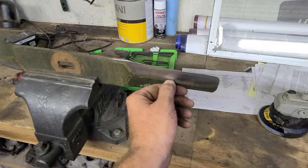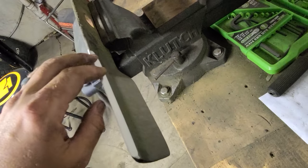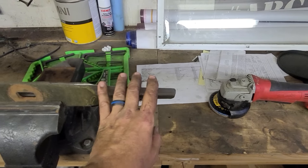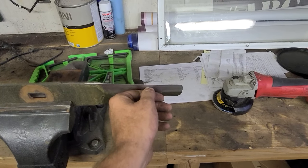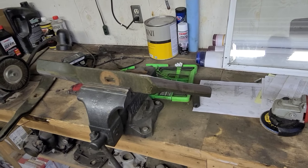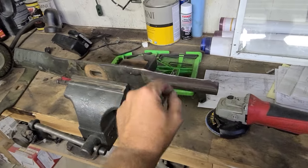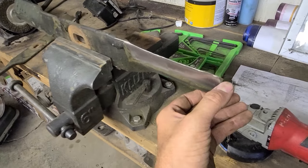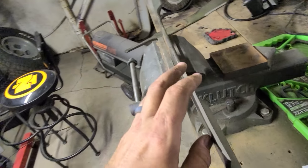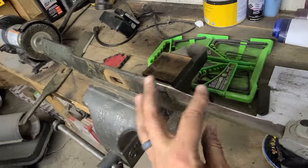You got to bring this material from back here all the way up, and then you bevel in the edge. See, sometimes you got to commit to it, put a new front edge on it. But the reason you do this is you got to prepare to resharpen it. Bless their hearts, both of them would sharpen their blades 3 times a week and then hit everything within a quarter mile. This is a different unit guy started into. It's got a pretty good wallop in her, and she's had some in the past. Next time this one comes in for service, I think I'll go ahead and just zip a new front edge on her. You don't want to get them too thin now, fellas.